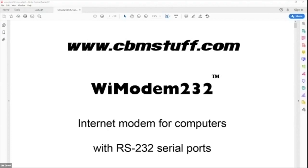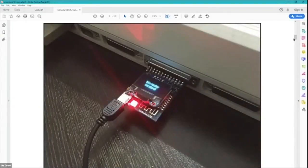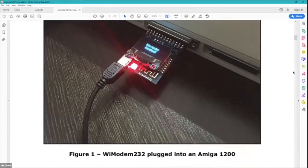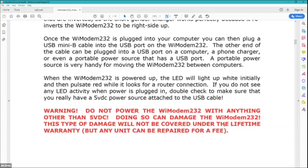Over here in the manual, I have basically a setup and installation guide, including how you power it. You power it through a USB device — I use an actual portable battery station, or you can plug it into a wall adapter like you'd use for your Apple iPad. It's a standard USB Type-A cable on one end. On the Wi-Modem itself I used a mini-B connector, and I did that on purpose because the micro connectors seem to break off all the time. The mini-B connectors are very robust — you can swing it around and it won't break off. Make sure you use a five-volt power supply; anything else can damage it.